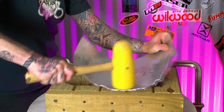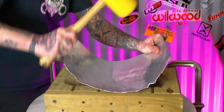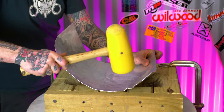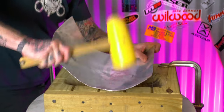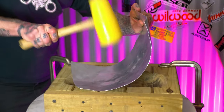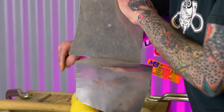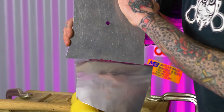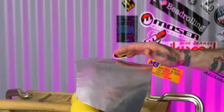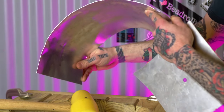I'm not driving into this material as hard as I can — I'm hitting it with a glancing blow. If I struck dead down into the material I'd have a greater chance of stretching it: I'd gather the material up, hammer it into the wood, but then the hammer would continue and act as a stretch instead. So it's lighter glancing blows that allow me to skip off the material — it goes slower but gives me more control in my shrink. You can see this piece now has a little hump in the middle from where I stretched it but the edge rapidly falls off with a harder radius — that's the shrink. I've actually pulled that material down around the corner by reducing the overall length of that side of the panel, creating a curve both ways.